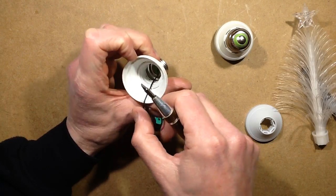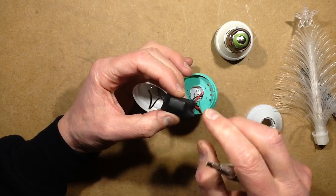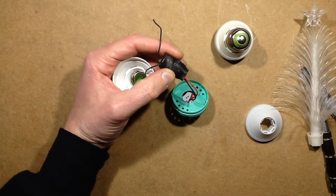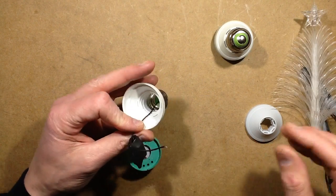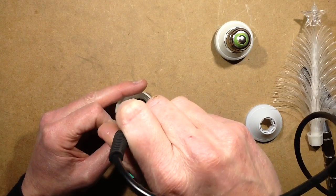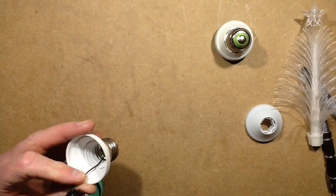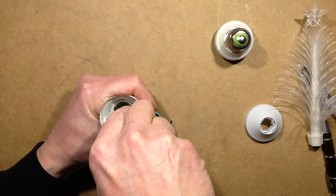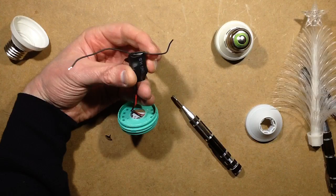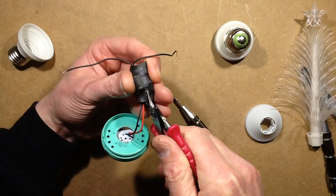I've just pulled a wire out — not to worry. It actually has that squareness — is that a capacitor? Let's cut this open. Let's desolder that wire from the back. I think that's solder — maybe it's not solder, maybe I'm doing the wrong thing here. Oh, I think that may just be one of those little skewer things that pops in and jams a wire in. Yes, it is. So let's clip this open with a pair of snips. I'm thinking yes, it is just a capacitive dropper — I may have to sleeve this afterwards.